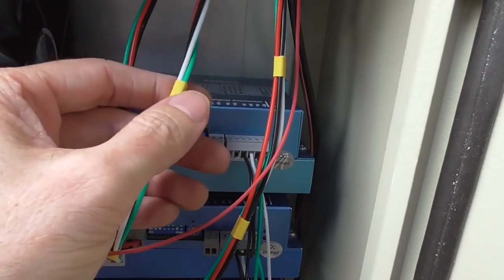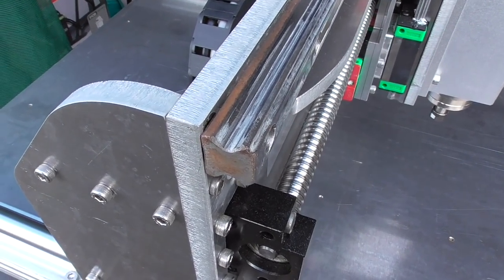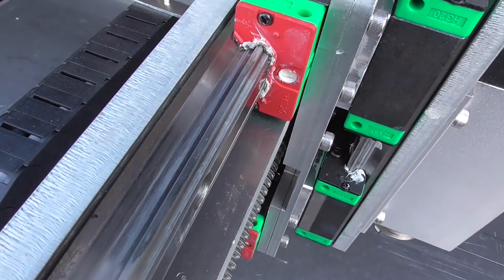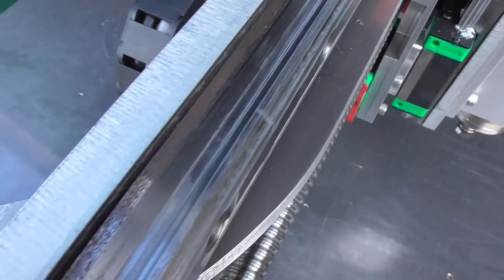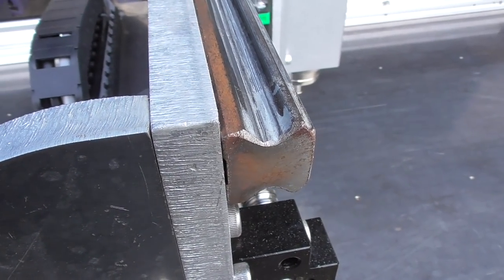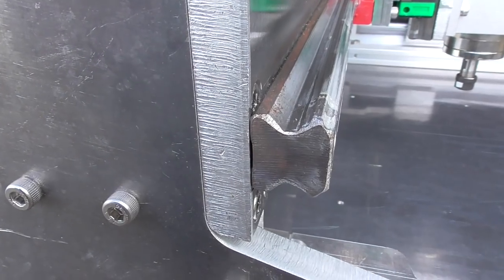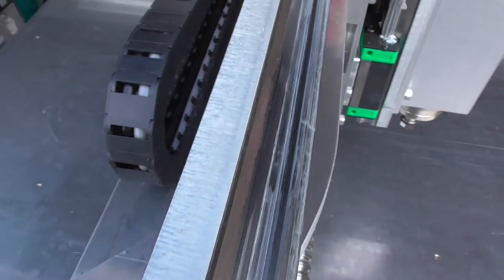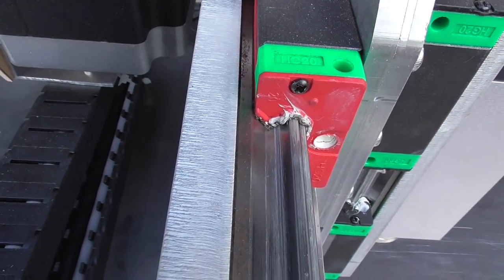The 60 volt stepper motor signals probably didn't need quite as much shielding. Looking at the linear rails the other day, I noticed they've got quite a bit of rust on them already — fortunately not where the balls are sliding, as running them up and down to grease that area seems to prevent rust there. It's a little bit disappointing — it hasn't even been that humid here, just a fairly dry summer. I'll have to scotch-brite that off and put some oil, WD-40, or grease on there.